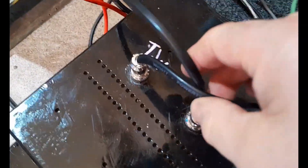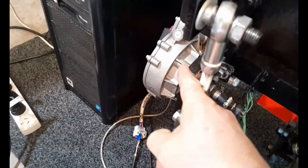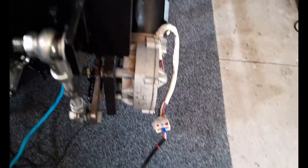I run my wiring out of the motor power supply side of the Sabertooth with a fuse on the negative on each side, and that runs to your motors. Don't ever wire your battery in between your motors and the Sabertooth or you'll cook your Sabertooth — only from the battery straight to the Sabertooth battery or power supply section.